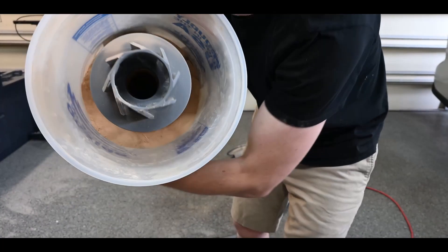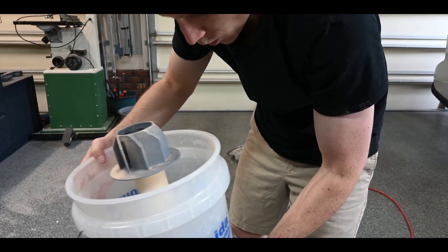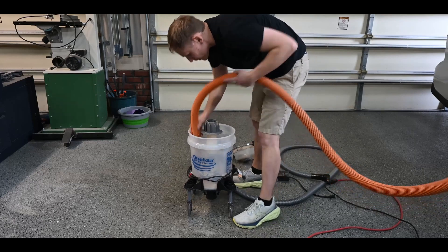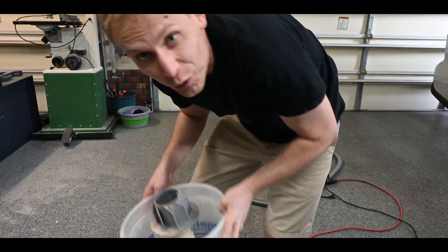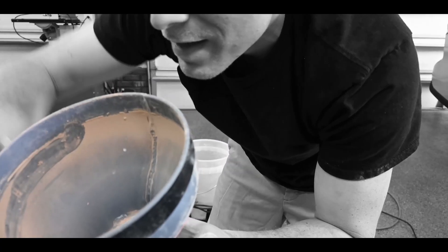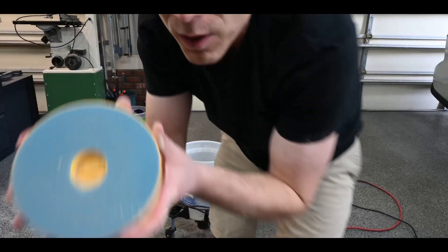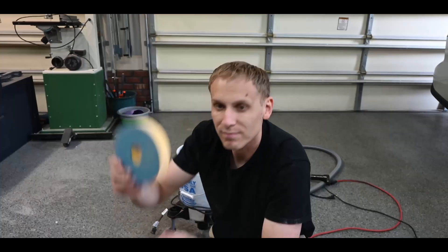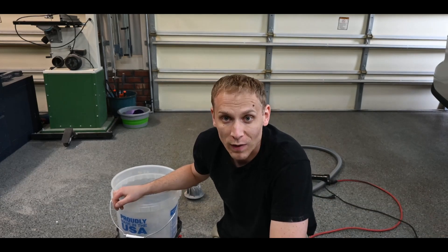As you can see, there's dust all around it. I can see a little bit of dust on the inside of the top piece, so let me vacuum that out and then we'll open it up and see what's in the filter. Now I've sucked up pretty much all that dust. The filter is all the way at the bottom, so this should be a true indication of how much dust made it in. You can see this was clean before — there's clearly dust getting in. And here's the filter — you can see dust all on the side there. It doesn't look like much got to the motor itself, but I think it performed kind of how I expected. I don't think the low profile Dust Deputy was ever meant to be quite as efficient as the regular Dust Deputy.